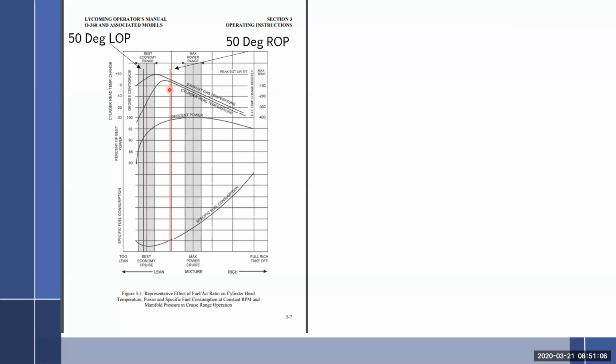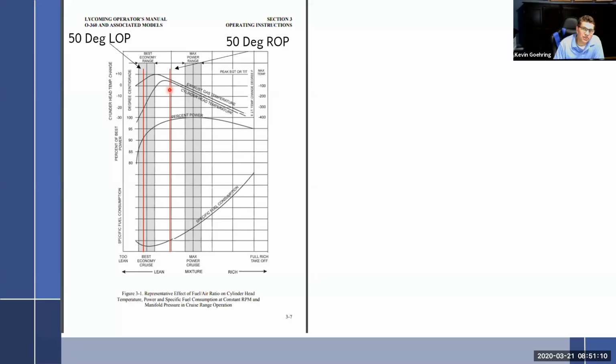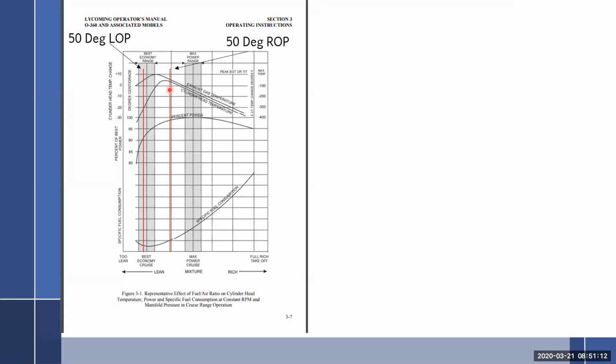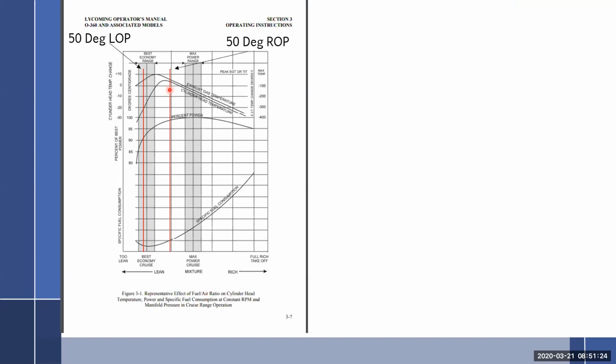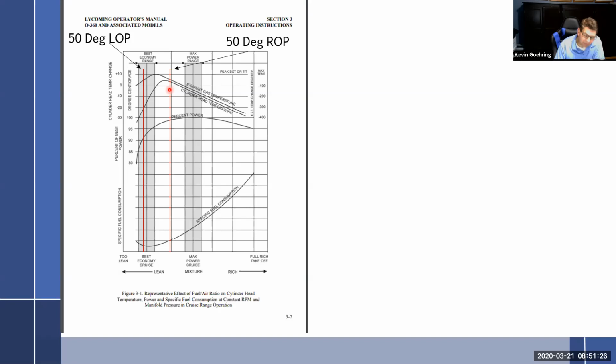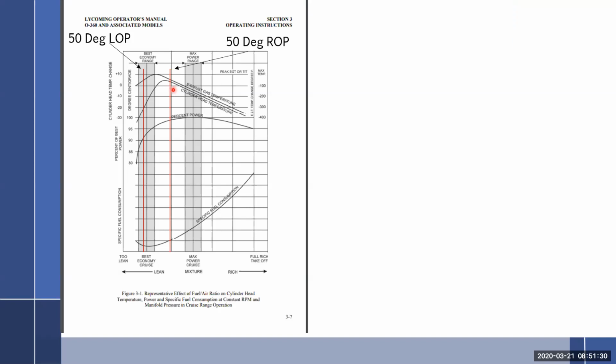And if we think about what cools the exhaust valve, a small percentage, we need the airflow being generated to find its way to the cooling fins on the side of the cylinder. So the only place the exhaust valve touches is the exhaust valve seat and the exhaust valve stem. And every time the exhaust valve is open, it's not even touching the seat.